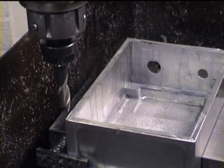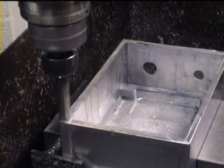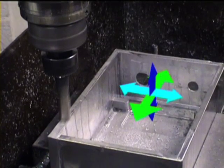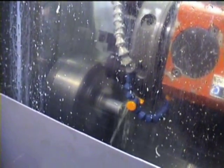A milling machine is one of the two basic machine tools, the lathe being the other. The crucial difference is that in a mill, the work piece being made is moved slowly around in three axes while the cutting tool rotates rapidly in a fixed position. With a lathe, it's the work piece that rotates quickly while the tool moves relatively slowly.